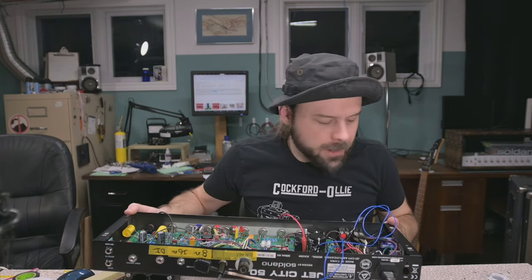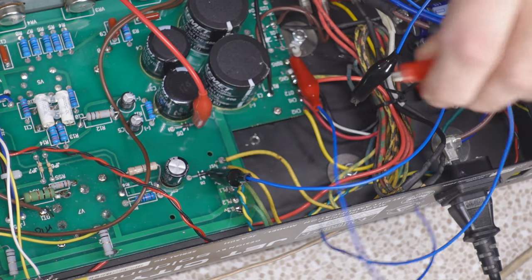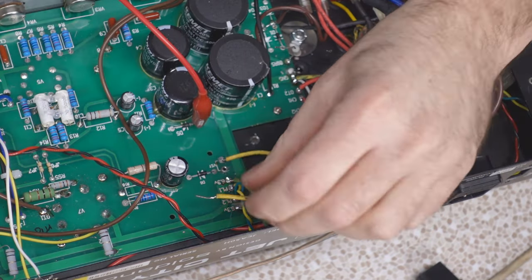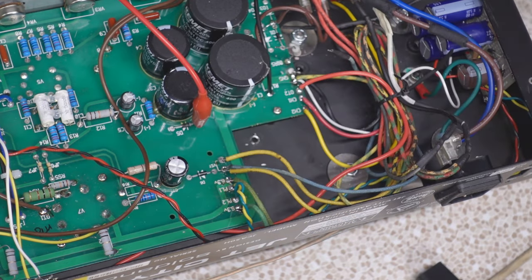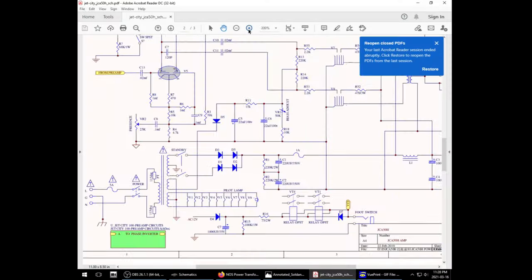How do we do that now? Okay, the black wire is connected to that hole. The black wire is the one that doesn't have heat shrink on it. We gotta get that wire out of there. Can we get these into the same hole together? We should be able to get both these wires through that one same hole and solder it in there, and get this bias lead back onto the bias port. All right, making progress now.